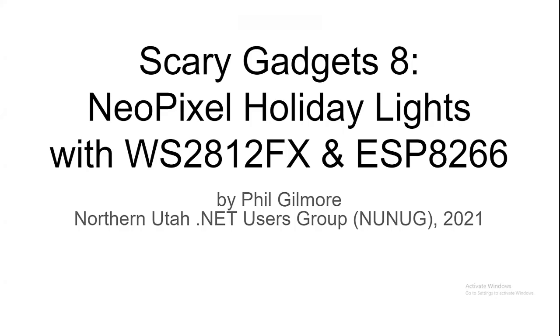For anyone who doesn't know what NeoPixels are, they are the Adafruit brand of lights based on the WS2812 LED controller. So these are individually addressable LEDs. You can buy an LED strip on eBay, and there'll usually be just RGB, so the whole string can be any color, but just one color at a time. The NeoPixels can be any color and any brightness on any of the lights on the whole string.